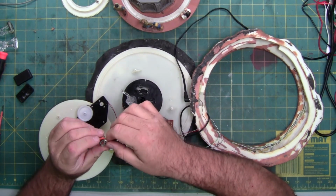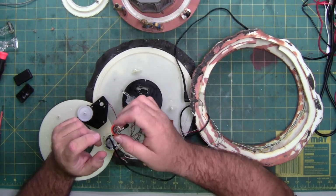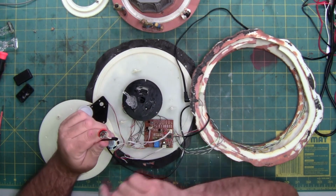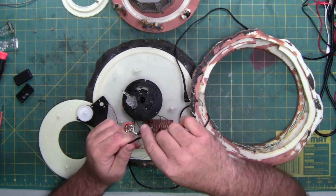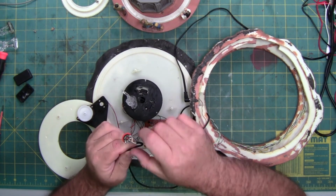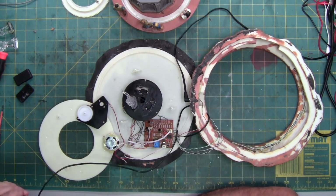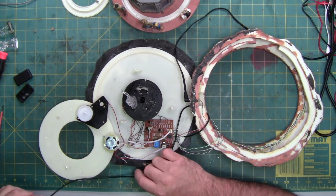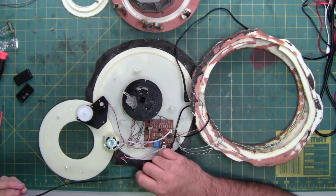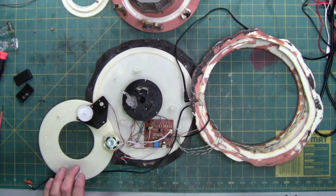This switch feels wrong because it doesn't have the solid connection in the on position, and that's where my problem is. Inside this switch that you can't see is a swiper arm as well, and I think that's where the failure is. When I'm wiggling this, I'm actually making that swiper arm connect, because it's actually a small potentiometer. That's why you get the volume control out of it, so it goes louder and quieter. So some basic information. It's a lot of information, but it's very helpful as it pertains to many different parts, or excuse me, other houses within the Lemax line.